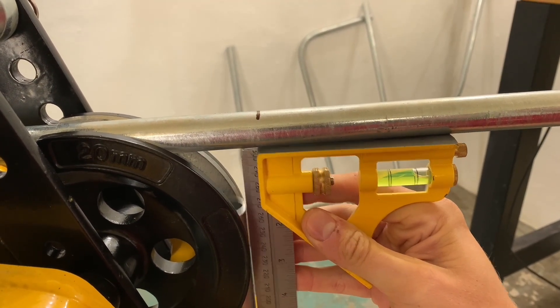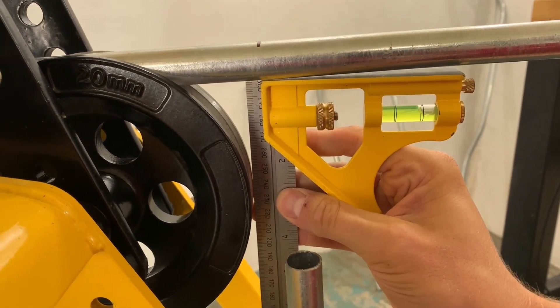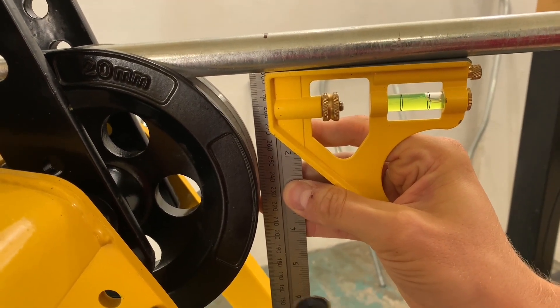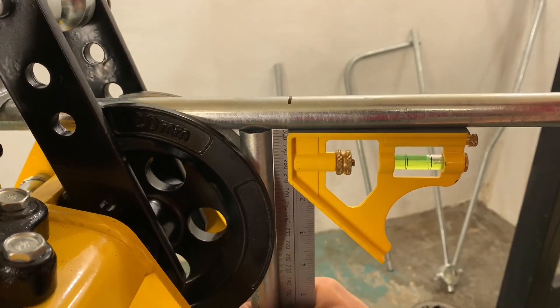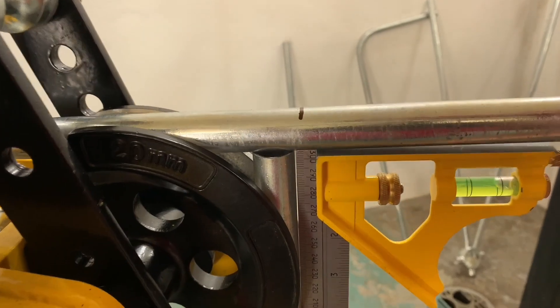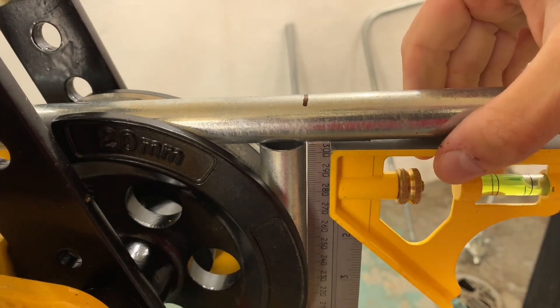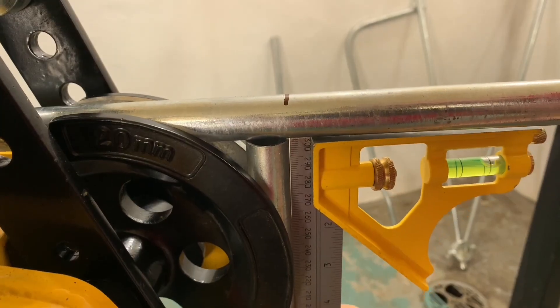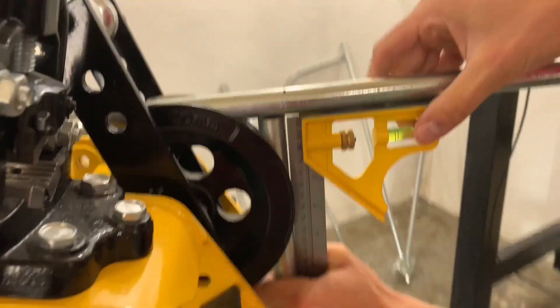It needs to go in a little bit further. Another way you can do it — you can also just use a set square, hold it on the edge of the former. I like to do it this way as it gives you two lines to square in: you've got both the conduit you're bending as well as the scrap piece. When that mark is lined up with the edge of the set square, that should be the back of the bend at 300mm — a nice easy technique.